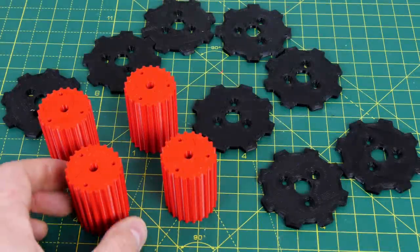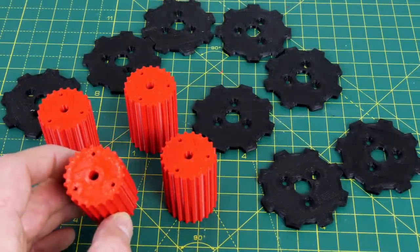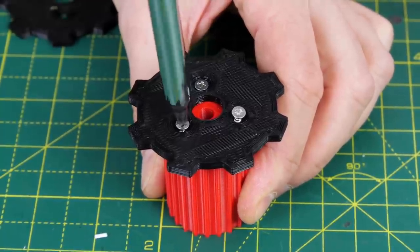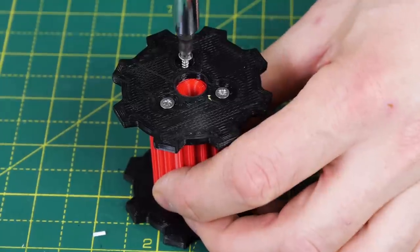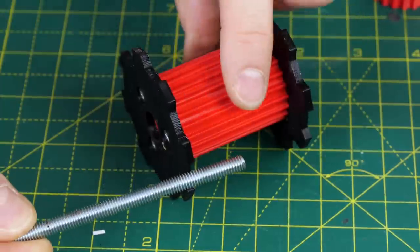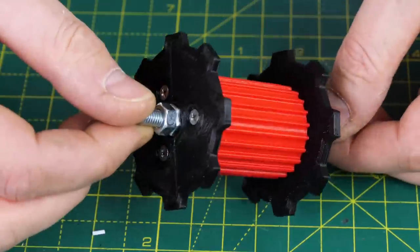So we need to make some sprockets and those are made of a bar which is actually a T5 pulley and some sprocket pieces which screw onto the end of those. Each end fits onto one of those bars and there's two ends per bar, so that makes a sprocket to drive both sides of the track. Those are fitted onto some 6mm studding which is bolted all the way through with a couple of nuts on each end done up against each other so they don't come undone.